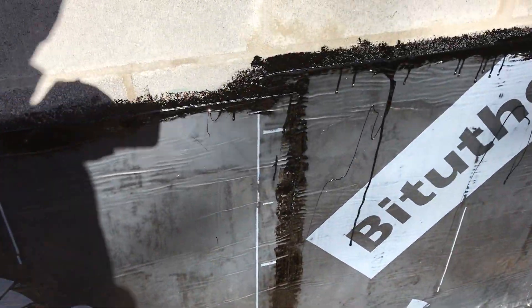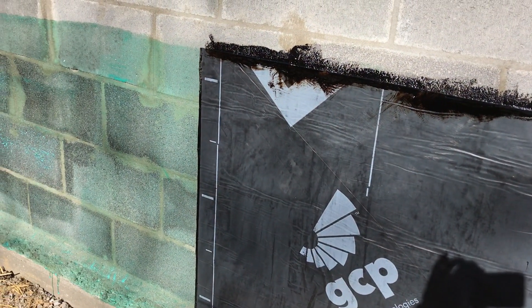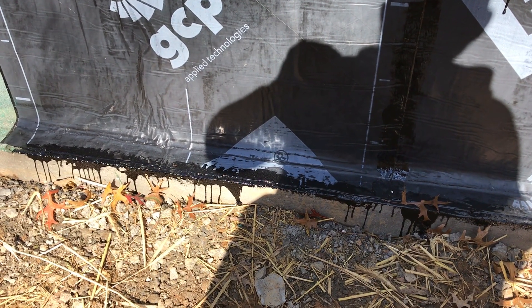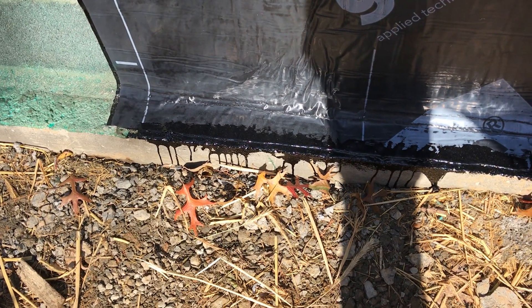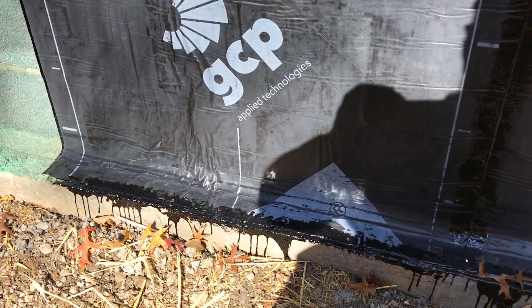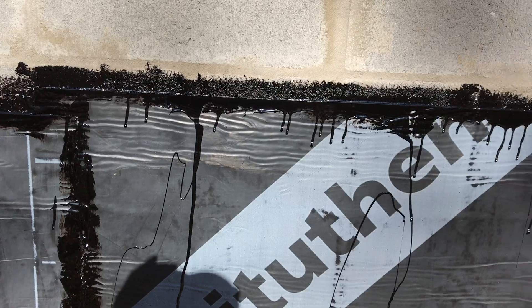I got that all the way around - walk over here to show you the waterproofing in progress. This wall has the primer on it, put on about 30 minutes ago. In this weather it takes at least an hour to dry. And here's the finished product over here that I did a couple days ago. The membrane sticks to the primed wall, goes across that seam and onto the top of the footing as well. All of the seams - the top, the bottom, and the edges where two pieces meet - I've covered with the liquid bitumen.